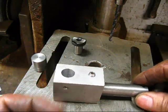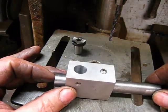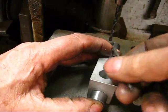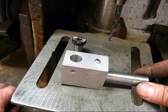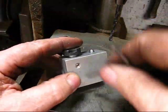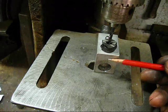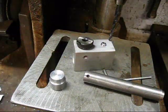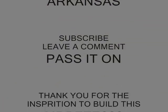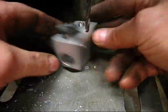If you remove the stop, this will go to any position where you want to drill your hole. In this case, I want it a specific distance from the end, so I put the stop in, put the raw material in, and snug up the set screw to hold it in the jig. At that point I remove the stop and install the drill guide — this happens to be a 5/32nds drill guide — in the top, and snug it up. If you're concerned about getting a hole through the round stock dead center, these work really, really good. I have one hole done, fourteen more to go. The drill guide works very good — I recommend this to one and all.